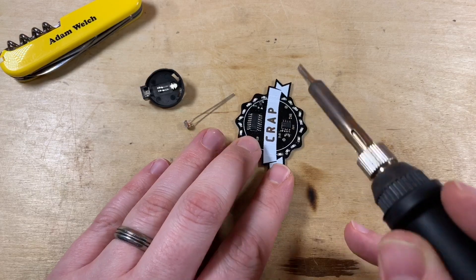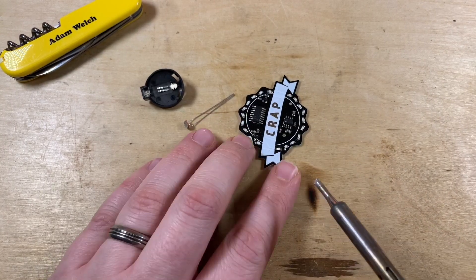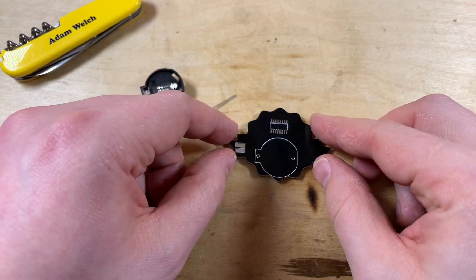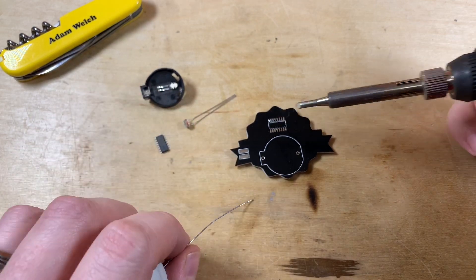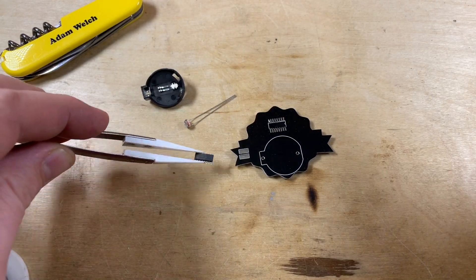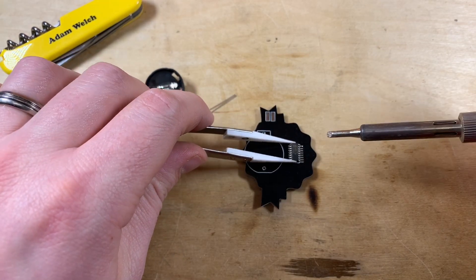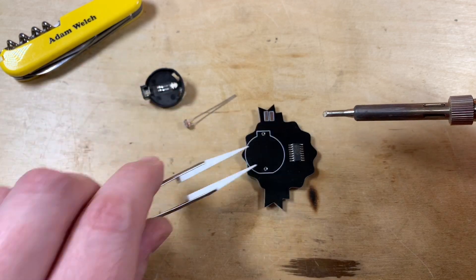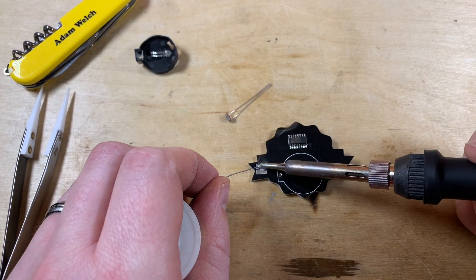Just a tiny bit of rework on those two pins — that's sorted. Now I'll see what happens with those LEDs. There is also the 4027 to solder on the back, so I'll pop a bit of solder on that pad, find the IC, spin it round, and get it positioned. That's not so bad — that will do. The 4027 is on; the LDR is next, which I think is meant to poke out a bit.